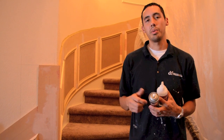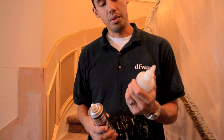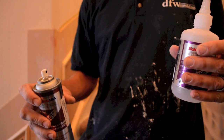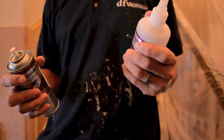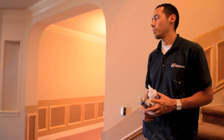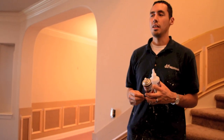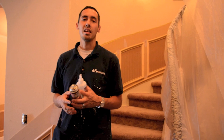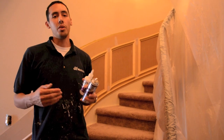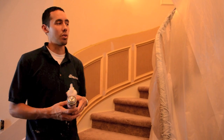I have a little piece up here that I need to glue on this curved wall, so I'll just show you how I do it. It's really simple — you put the glue on the piece and then you activate it by spraying the other piece. We use this anytime we have an outside corner or a seam, really anywhere where you need two pieces of wood to stick together fast. This is instant glue — you've got about eight seconds to work with it, so when you connect your pieces they need to be exactly how you want them to stay.